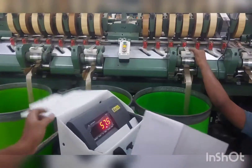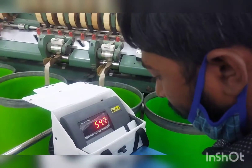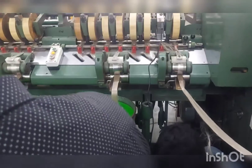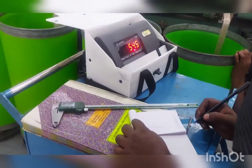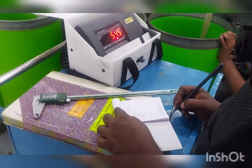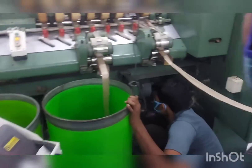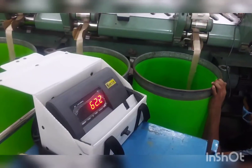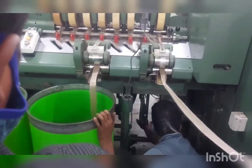The same procedure can be repeated for the other top rollers. Every head of the top roller has to be checked for this load so that a uniform setting is ensured throughout the machine. Machine 284 is similar to this and the same procedure is applicable there too.